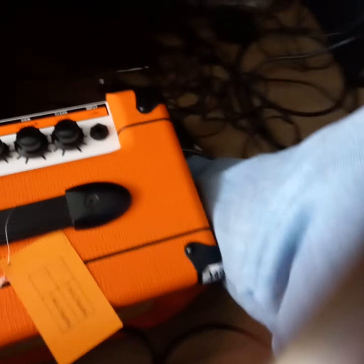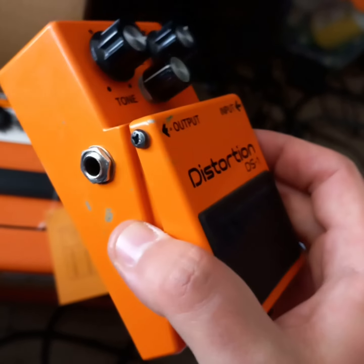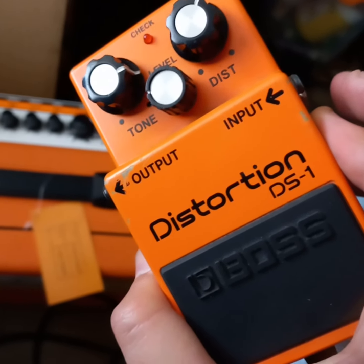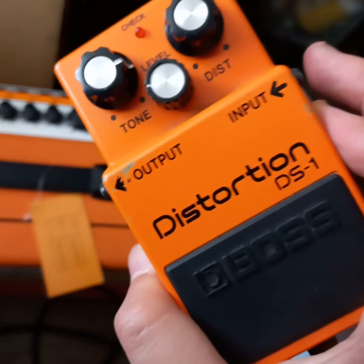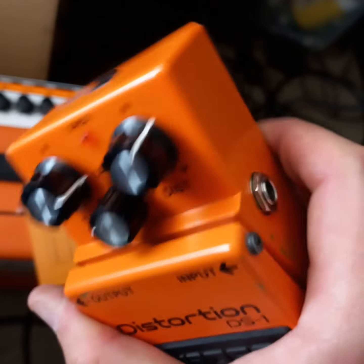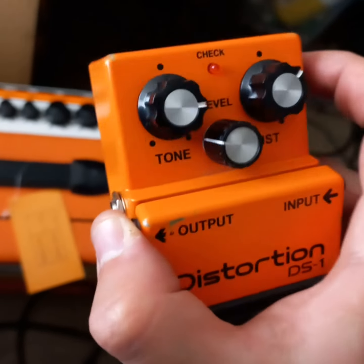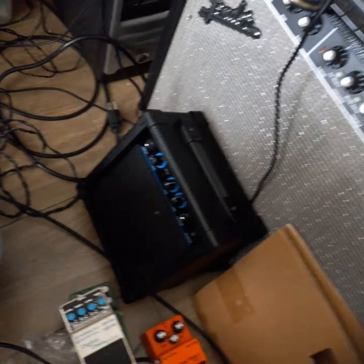For example, that pedal that I was talking about, I thought the pedal was damaged because I was putting a wrong plug on it. I opened it and looked at every single component, and nothing was wrong with it. I didn't know what was happening. I thought it was bad solder and resoldered like 5 or 6 joints, then put it back together and realized maybe it was the IC. But then I switched the cable, and all of a sudden it worked. So I was wrong, because I was in a hurry to get this to sound tighter.